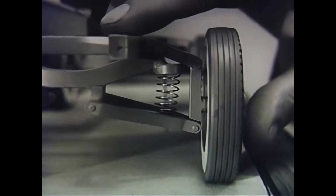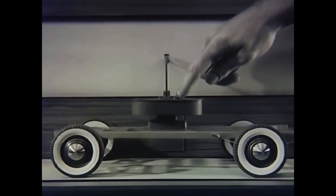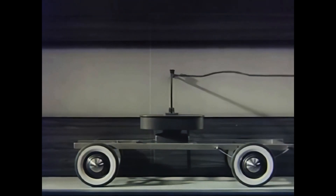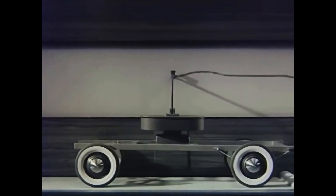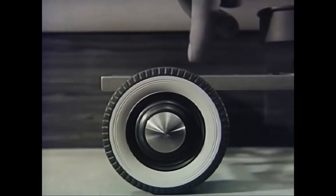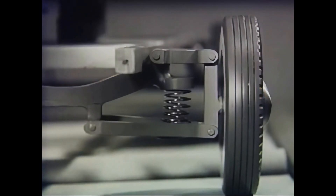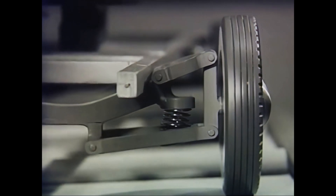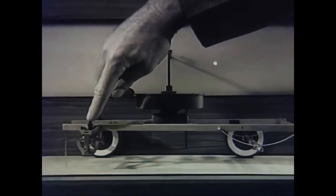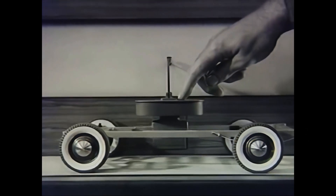Since the rigid beam and the swinging arms keep the front wheels in line, there is only one job left for our springs to do. With both front and rear springs equally soft, the platform is held in balance. But now that the front and rear springs are soft, we have another problem. Springs that are soft enough to level out the bumps will compress too rapidly under a heavy shock. And springs that are soft enough to absorb small shocks have a tendency to continue bouncing after they have been compressed or stretched. So to help the springs absorb heavy shocks, we can slow down their action by means of shock absorbers. The shock absorber acts like a brake in delaying the movement of the spring, and it prevents bouncing when the spring is compressed and then released.